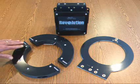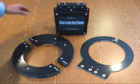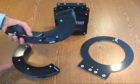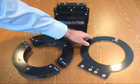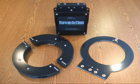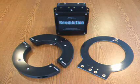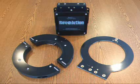components: the rotating coil collar assembly, the stationary power coil, and the master control unit. The rotating collar assembly is machined to exactly fit the shaft and carries the transmitter module that is wired to the strain gauge. The power coil is fastened to the mounting block on the master control unit and simultaneously sends power to and receives data from the rotating assembly via an inductive link. The master control unit, or MCU, contains the connections for power input and the 4 to 20 milliamp output signals, as well as the control switches for configuring the torque and power outputs.